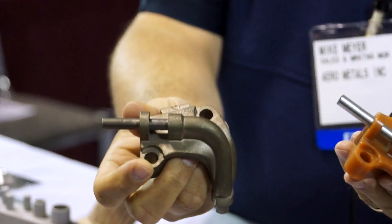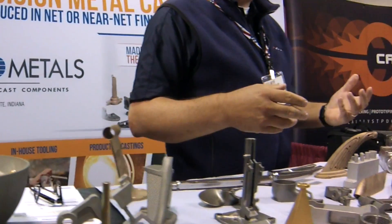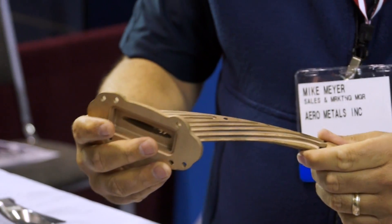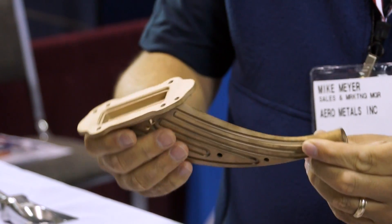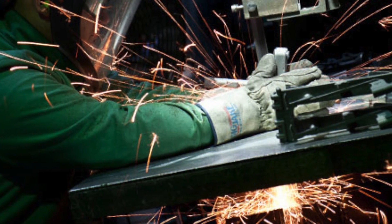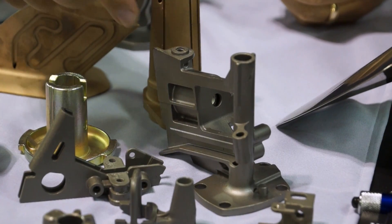We use all sorts of metal alloys — from steel, stainless steel, bronze, copper. This happens to be beryllium copper. We are one of the very few foundries in the United States that pours beryllium copper. You have to have a very controlled environment when you're dealing with beryllium copper, so we've invested in an area almost like a clean room to process our beryllium copper components after casting.